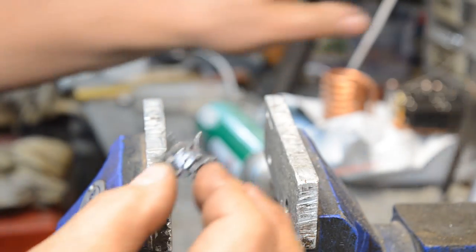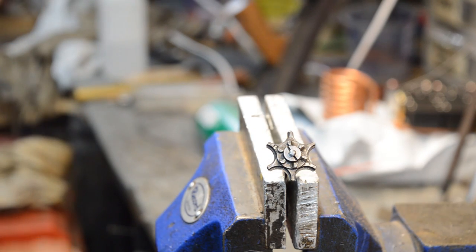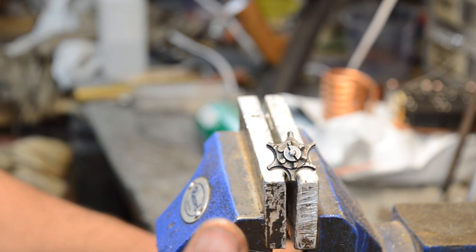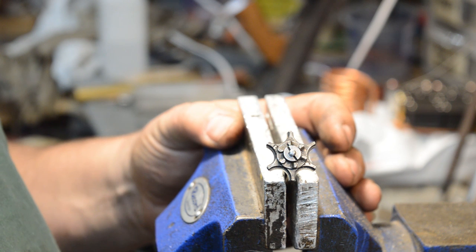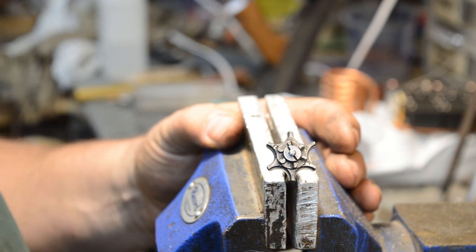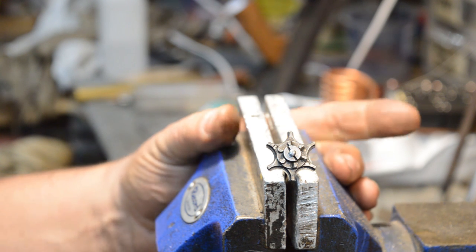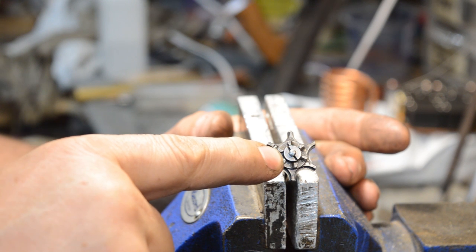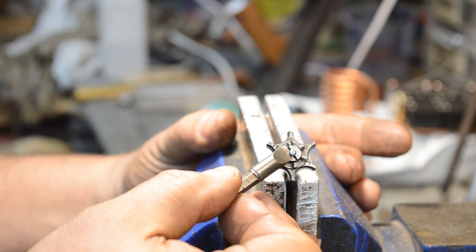Now I'm looking at how we turn this particular fastener without damaging it. We don't know if it's been staked. We don't know if it's been Loctited. We don't know anything. While this is a pretty funky combination of technologies, there's nothing in this revolver that isn't just standard gunsmith work. The Italians make some pretty sexy stuff, and this is no exception. My guess is that's a threaded stud, so now we need to make a spanner that will go across that. This is an old broken screwdriver tip — and this is why you keep these things — we're going to make a spanner to fit across that.